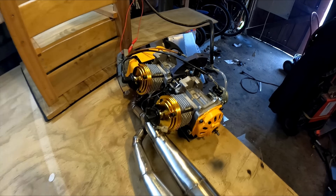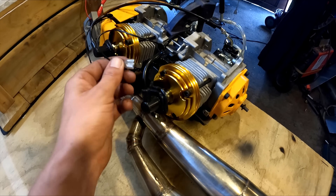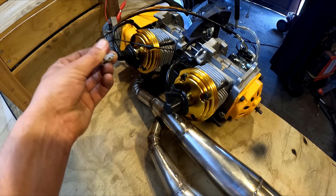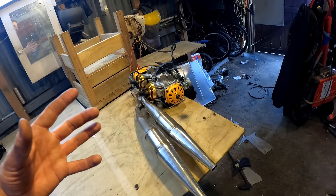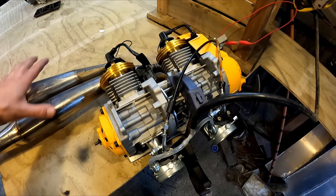Need to hook up an off switch — I don't know if you can hook these together and have one off switch; I think they might interfere with each other. You'd probably need something that presses both earths at the same time. The little plastic bush in here took a beating. When I first started up only one of them was running — I don't think I had the plug on properly and it really chopped this out.